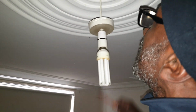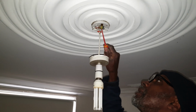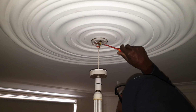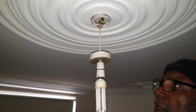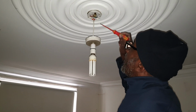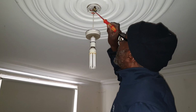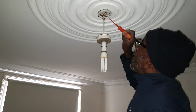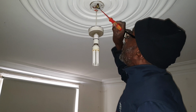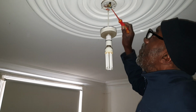Oh my gosh, look again. It's got to be joints up there because there ain't enough cables here for a circuit to continue. You'd have live in, live out, live to the switch line. So in the middle there you'd have 3 lines. Then you have neutral in, neutral out, so you'd have 2 neutral. This looks like the end of a circuit rather than the middle of a circuit.